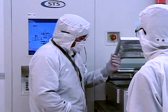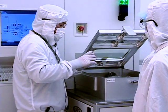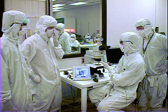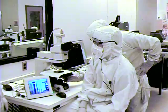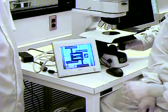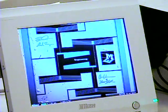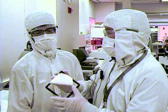Here we're unloading the wafer out of the chamber — it's already finished etching. Because it's been etched through and it's on glass, certain features are going to be transparent, so you should be able to see right through the wafer. Now our wafer is complete and we want to examine it, so we put it in this microscope. The microscope is attached to the screen so we can see how the wafer actually turned out. Here's our design, and you'll notice we have some pieces of artwork which are fairly common in research projects — our signatures and a Michigan Engineering logo. We used this mask to transfer our pattern onto the wafer and into the materials on the wafer.